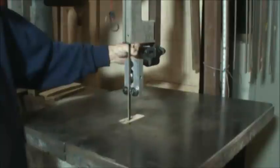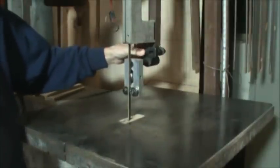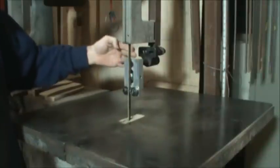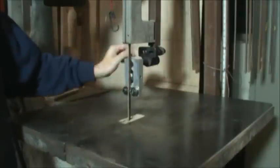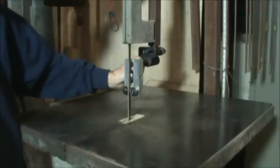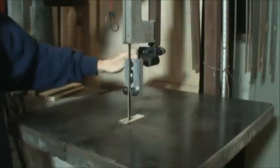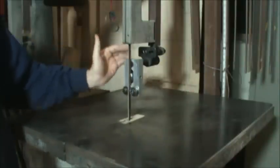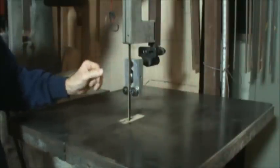This is a really nice guide mounting assembly here. You've got this one bolt in the middle which you can just loosen up and slide the whole thing side to side, and then there's another big bolt on the side that you can't see here that if you loosen it up you can basically turn and twist the assembly to get it exactly lined up.